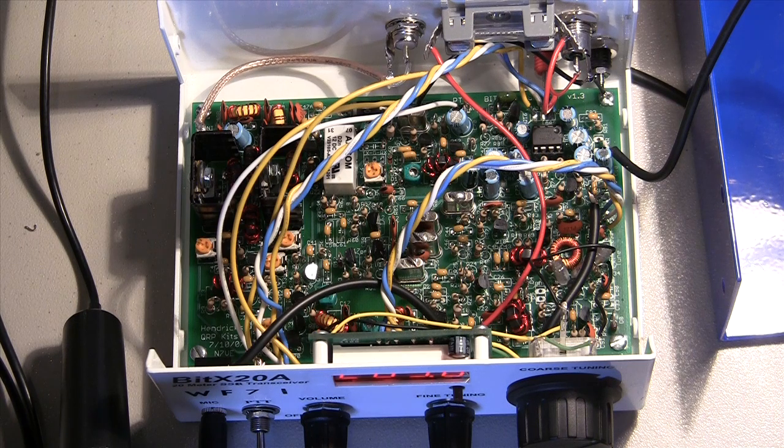I've had a couple of problems with oscillations breaking out when I had the drive adjusted a little high — there are some feedback issues with this radio that I'm probably not going to fix with this kit. I think I'm going to leave it as is. Five to ten watts is fine and I'm happy with that level of output. I know some guys are able to get 15 to 20 watts out of it, but I'm not going to be able to do that without the oscillations. I may shoot for that with a future build, but I'm happy with this — it definitely does a job.